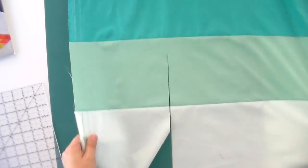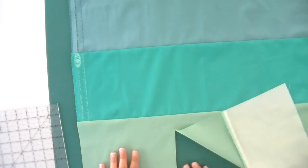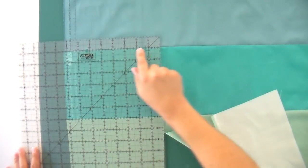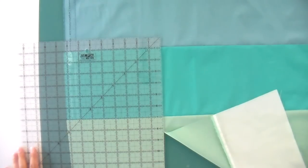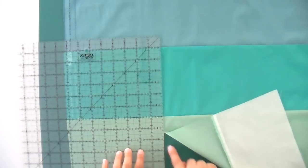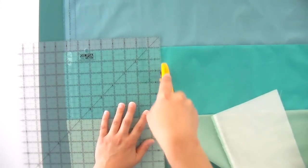Now that I'm happy with where everything is, I'm going to trim this first section. I'll pull that toward me and try to keep everything as flat as possible because we're going to have to cut it in sections — there isn't a ruler long enough to cut the whole thing in one go. I'm going to pull this up to the side so you can see where this cut ended. Now I've got two seams I can line up — I'll get a nice inch mark over each seam, and if I've done my job right it should also be in line with that first cut we made so we can confirm we're square here, here, and here for a nice straight row.